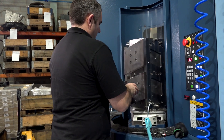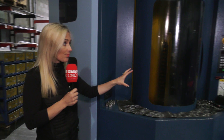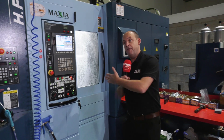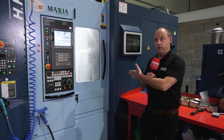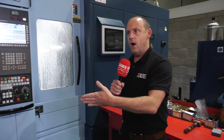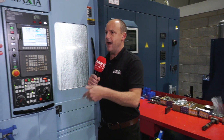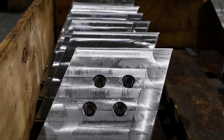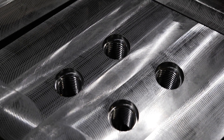They're putting bigger parts on this machine — more capacity, hard materials, heavier cuts, and an 80mm face mill that they're machining on these parts. They need to do this throughout the night as well. Sometimes when people run unmanned they put their lighter, less tricky components on, but they can't do that here — this machine needs to make the parts in question.